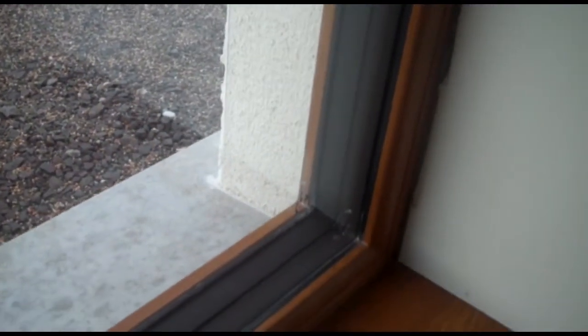Triple-glazed windows with a U-value of 0.8. The walls are deeper than a low-U house — there's about 350 millimetres of insulation in the walls, and that's crown wool. There's 650 millimetres of crown wool in the ceilings, in two layers with an airtight membrane between them, as is the case with the walls. The floor has 175 millimetres of polyurethane insulation on to the cement. Through the Passive House Academy, we're told this is the optimum — any more is really wasting money, any less just isn't good enough.